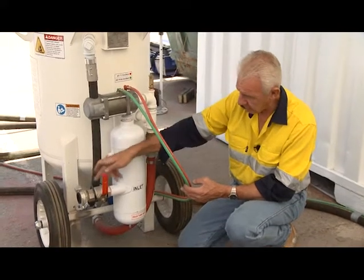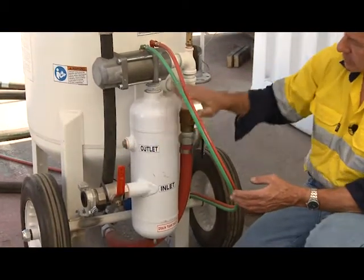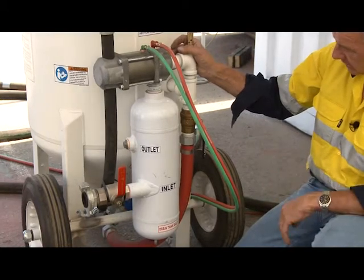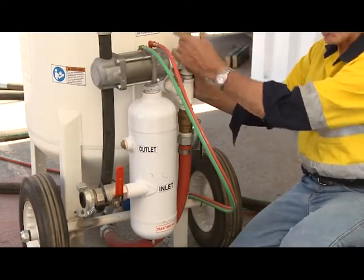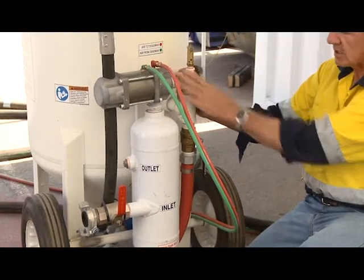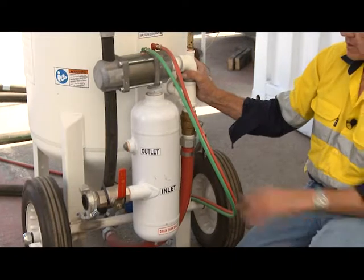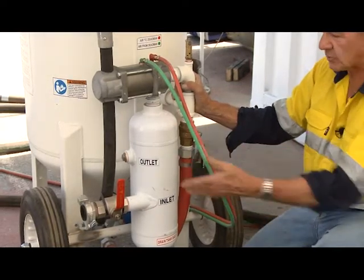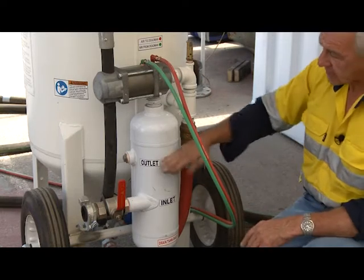This valve enables me to stop the flow of air into the moisture separator before it goes into the combo valve. Turning this valve off will deem the pot inoperable, which is important because a pressurised pot could result in injury if you start unscrewing components. When something's under pressure it's very difficult to undo — so do your checks first: is the valve off? Is the drain open and weeping air? If not, you're safe. It's also important to isolate the source of air — the compressor — and let people know you're working on the pot. You can also disconnect the bull hose to make sure the pot can't be filled with air.